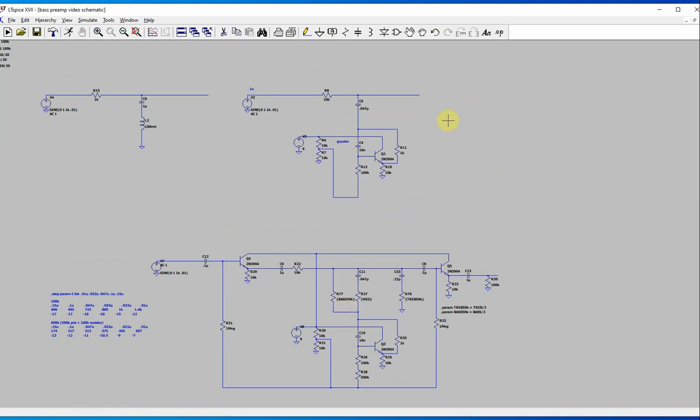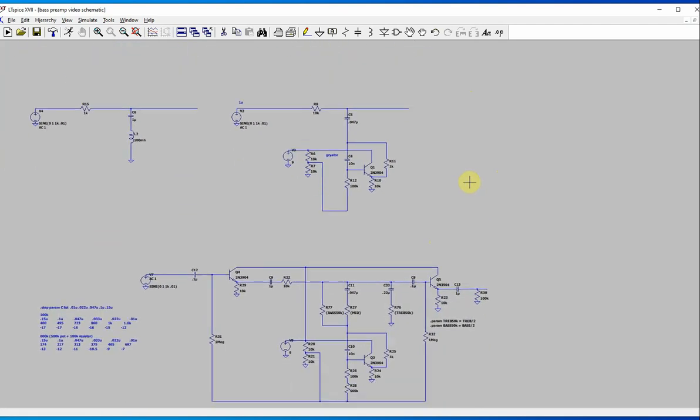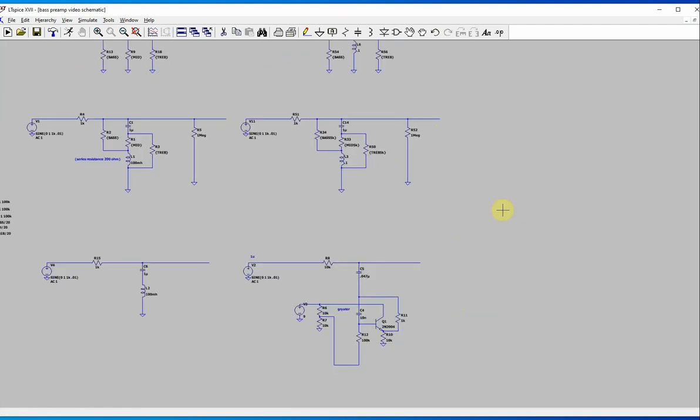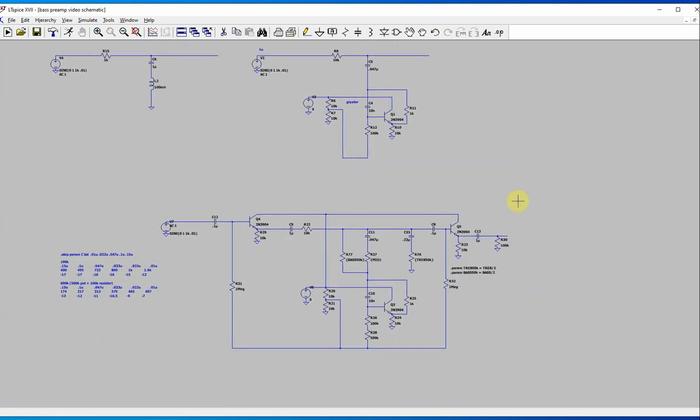Now, you can also make a treble control if you go around it this way, and you can see that in my other video. But instead of doing that, I'm making a second treble control more similar to this setup here, where you have a separate bass, separate mid, and separate treble control. Because I just want to be able to vary the cutoff frequency on the low-pass filter, or treble control, they call it. So you can see I end up using a different capacitor here.